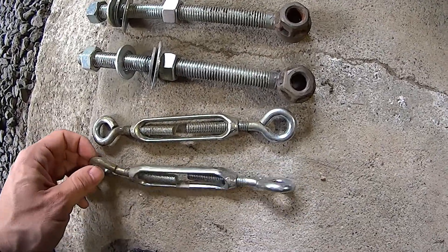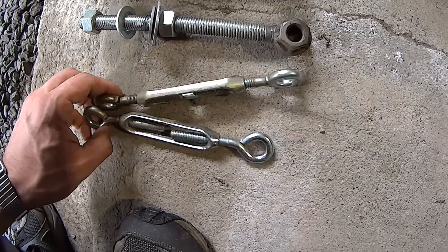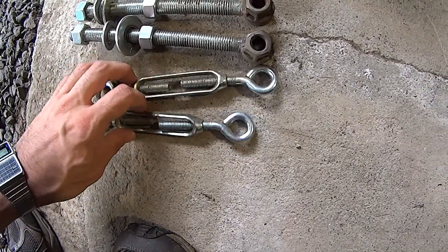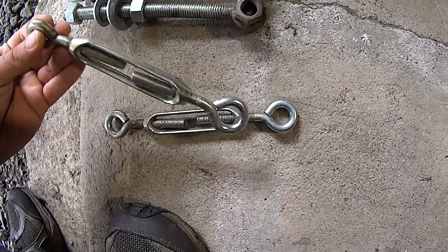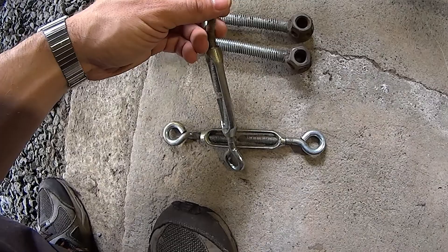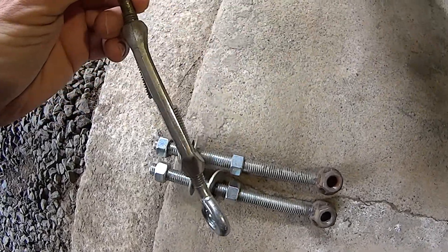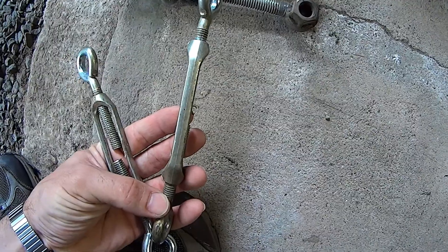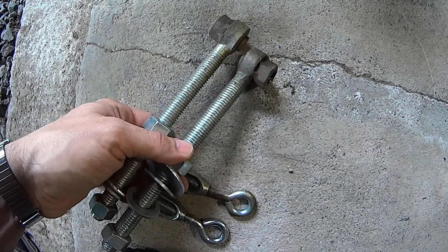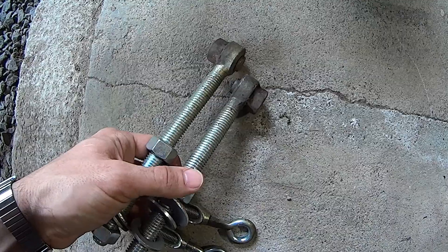Upon dismantling this whole thing, I've realized a couple things I learned a long time ago that I kind of forgot about. As you can see, I've got two different mechanisms to adjust the height on the deck. Originally I believe all four were this style, but they're no longer that way because if you look at this one, she's a little bent. These weren't very rugged when the deck hit something and the mower kept driving. Both of them are junk. That's why I ended up doing the back-only conversion — it was enough to keep everything solid, and it worked, so I didn't end up converting the front.